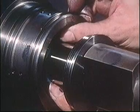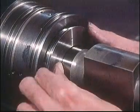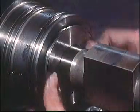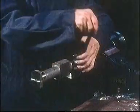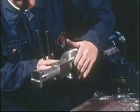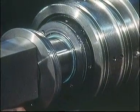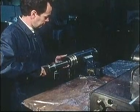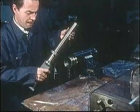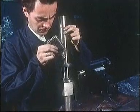Slide the sealing ring into position in the spacer and press it home with the circular nut, which is then screwed out again. Now carefully withdraw the plunger from the barrel. The spacer and sealing ring will follow the plunger. Check that the sealing ring and the rubber ring are correctly positioned in the spacer.